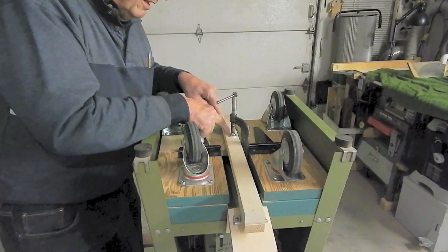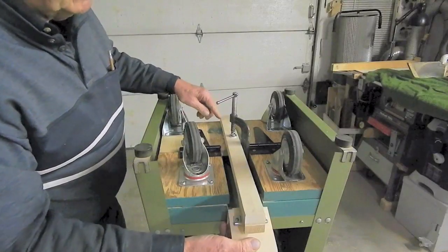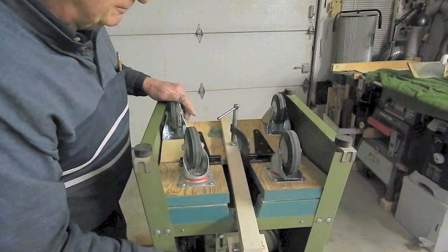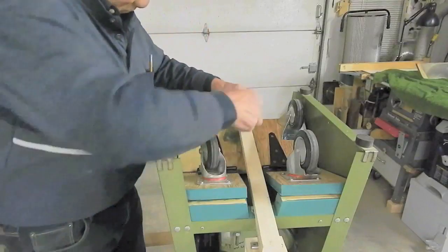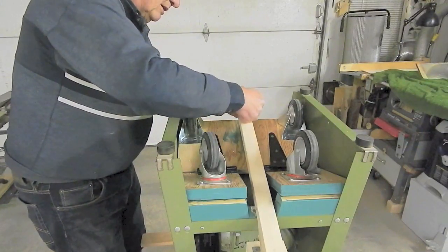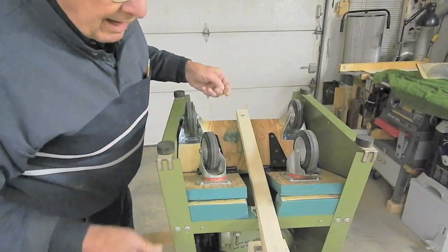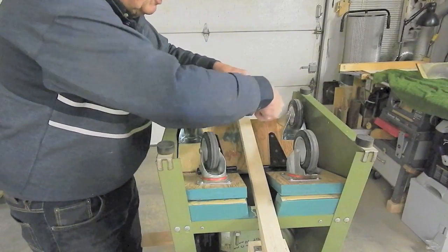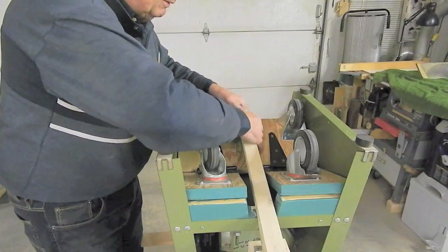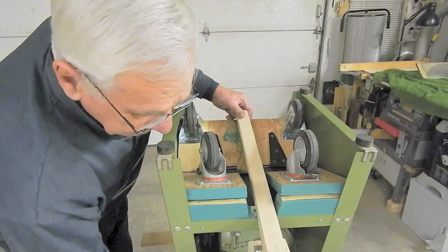Just need to drill and install a couple of bolts. Everything seems to be working just fine. By using a couple of bolts here, I can add washers between the arm and the rear plate as necessary to get the right travel on the arm.